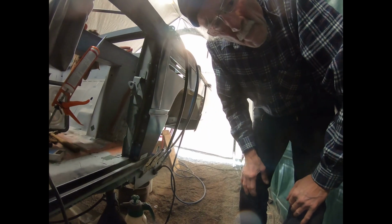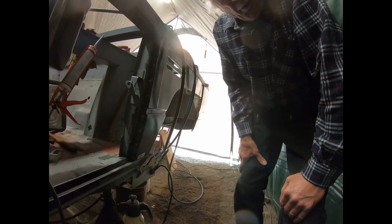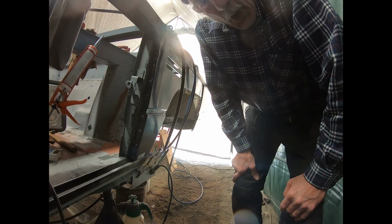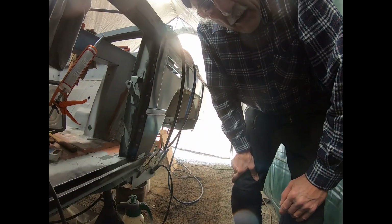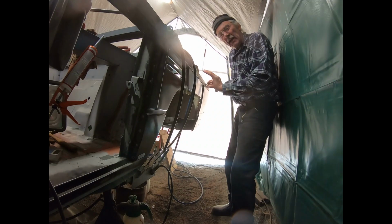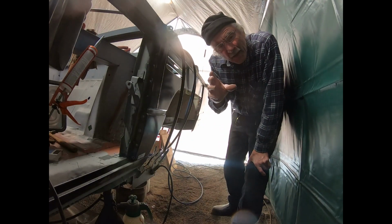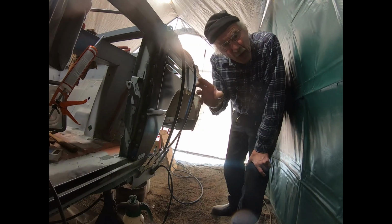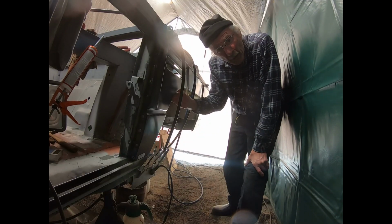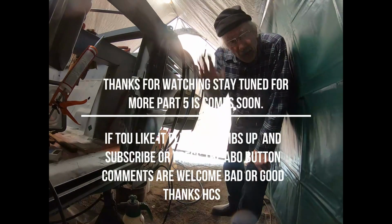So, the welding of the closing panel is done, and it sits very well, and it fits also very well. The next thing I'm going to do is to weld in the wheel arch here, but that I will do later. Before that I am waiting for the original paint from Volkswagen. I have to paint it first in the original colors, and then I can close it here.